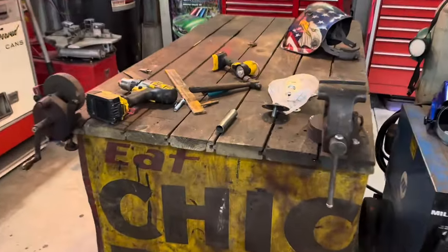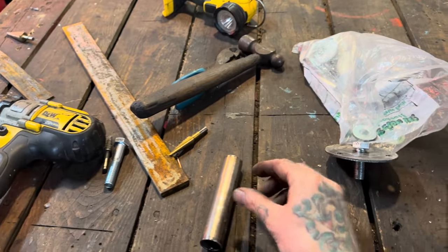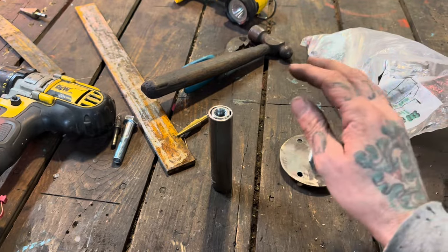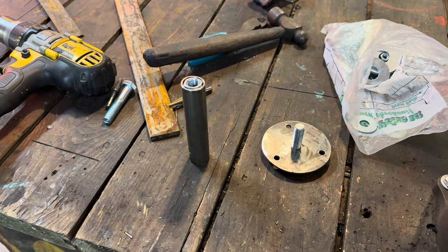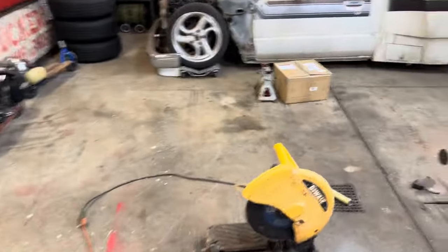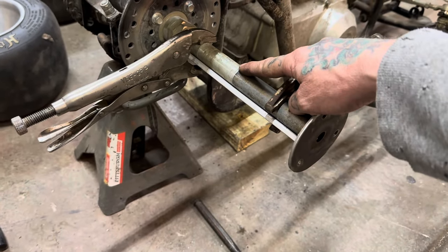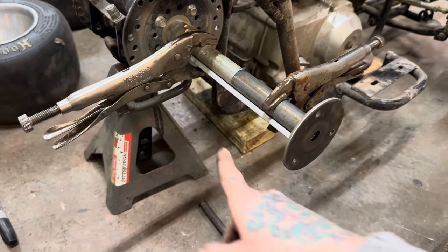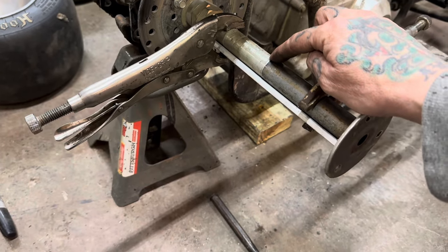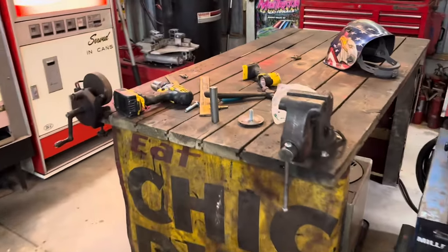Just a quick look before I go any further — give you guys an idea of what I came up with. I got my tubing cut to length, and just like before, I found a nut that fits perfectly inside there. I did have to drill the center hole of my plate out a little bit, but that'll get bolted together before I weld it, just so I know everything's dead center and good to go. I like to use bolts, nuts, and washers like that because I'm no machinist — it helps to keep everything in line. I already got the other side welded up and hammered onto the axle a good bit, so I know that's nice and centered. Just in case, I went ahead and cut a piece of angle iron and clamped it to both sides so I know everything's good to go. I'll weld it and also drill some holes to plug weld it at the end. So I'll go ahead and get this side made up and hopefully everything works out.